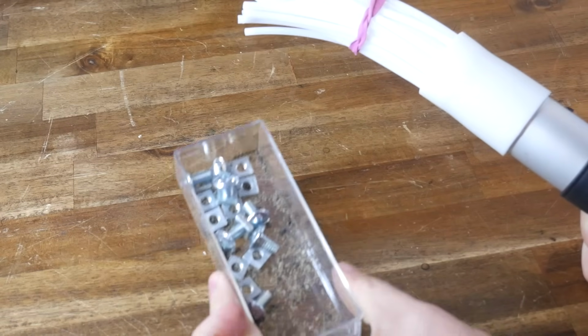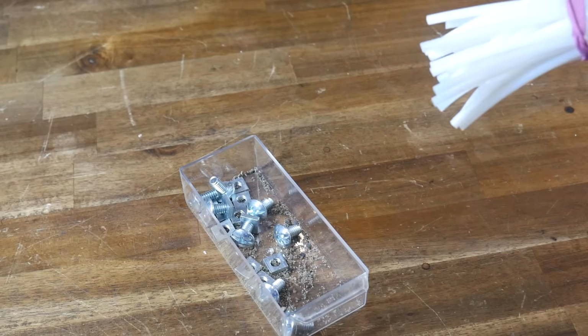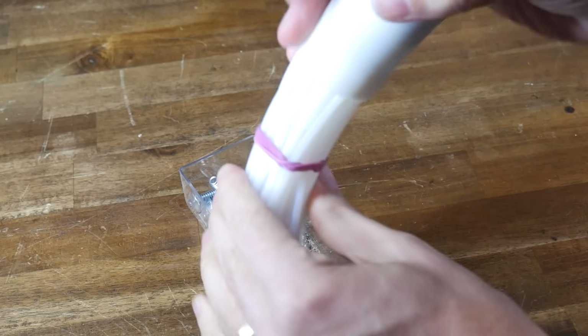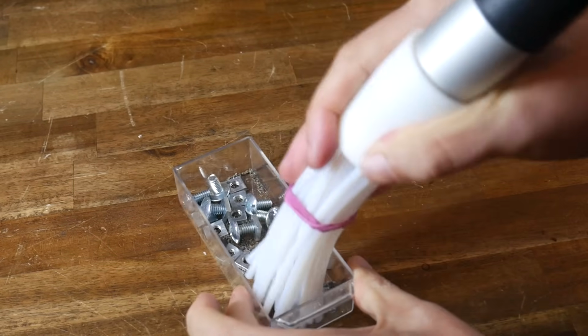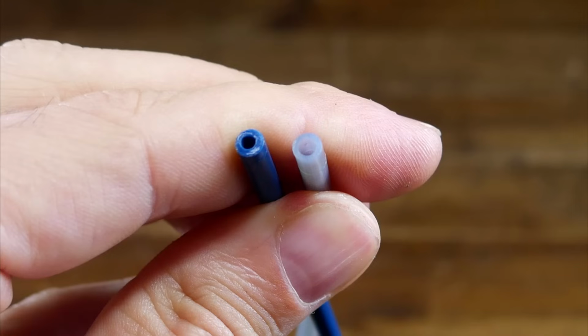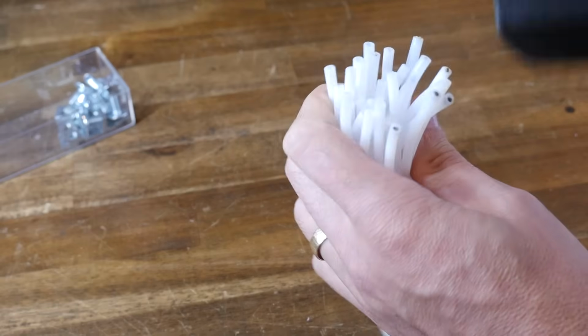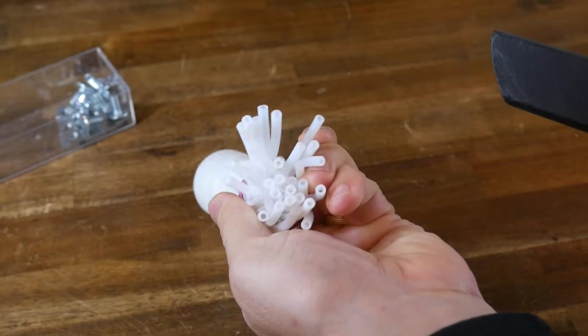Well, here's an exaggerated example. When you've got a bunch of small components surrounded by dust, sand and dirt, and you don't want to pull them all out to vacuum the bottom. This vacuum head will suck up all of the small bits of debris, but none of the individual tubes will be strong enough to attach to any of the larger objects. Ideally, when you make this, you'll use 4mm tube but with a larger bore, and that should stop any larger elements of sand clogging up the PTFE tube, although it's not too bad to suck these out with the vacuum and another nozzle.